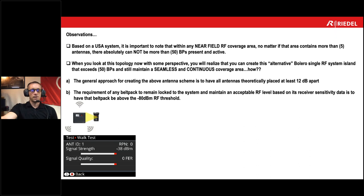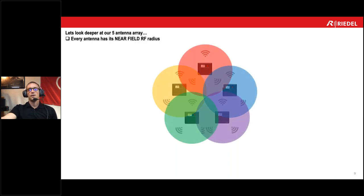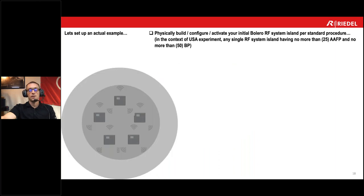When Dave shows his graphs of these things, they permeate like donuts, like a circle around. And you know that there's two omnidirectional antennas, but those antennas are at 90 degrees in the box, right? Yeah, exactly. This is almost a bad example for me to pull up right now, but it's permeating from around that device. Obviously, RF doesn't pass very well through the back of the antenna because, well, it's metal. Makes it a little hard to pass through there, right?